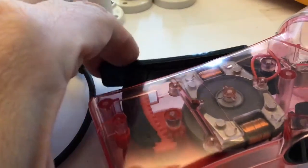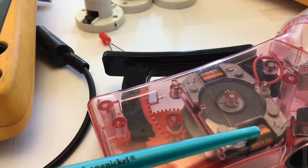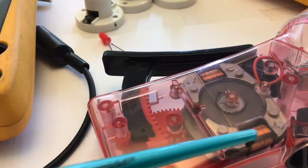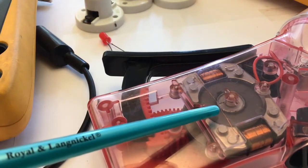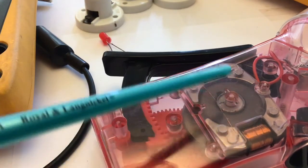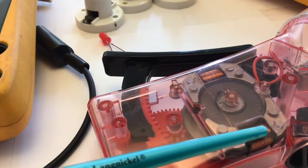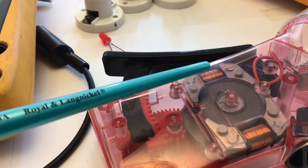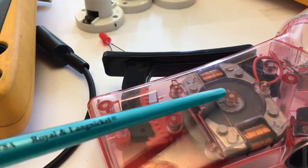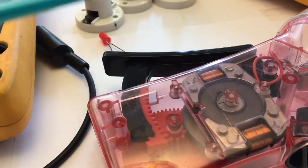You notice how when I pump it, this thing is whipping around in there. And these are obviously coils of wire on either side of this. So this disk is actually a magnet. Right now when this magnet isn't moving, there's no changing magnetic field and so there's no change in the flux. Faraday's law of induction says a change in the flux will create a voltage and current. So there's no change in the flux, so these coils aren't picking up any sort of voltage. The generator doesn't work unless this magnet moves around. Because it's moving around in a circle, it creates a change in magnetic field at a constant speed and we get pickup.